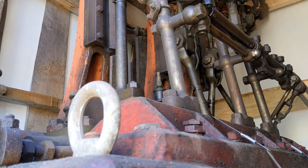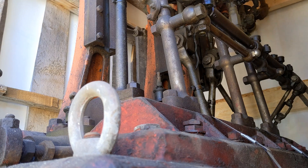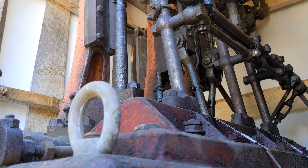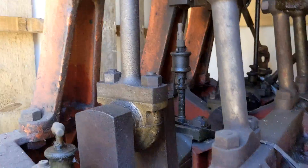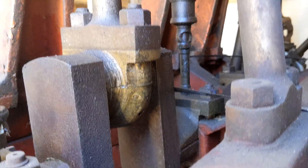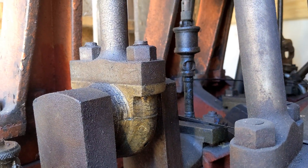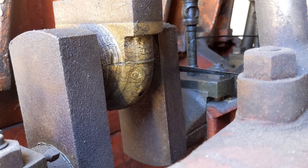I can hear a little bit of slop in some of the bearings there, as can be expected for an engine that's about 120 years old — those will all be gone through and taken up. What needs to be renewed will be renewed. This is really interesting here: the big end brass cap is using studs with nuts, and the cap is rounded off on the bottom to save weight.